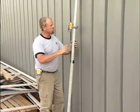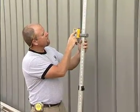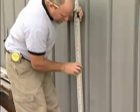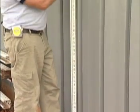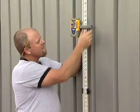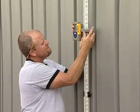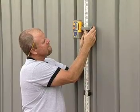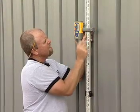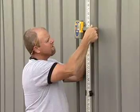We're simply going to switch it to the on position. You hear it beep — this does require batteries. Here is an indicator that I do in fact have it turned on. So now I'm simply going to put the bottom of my story pole to the elevation right there. You can hear it beeping. Now I'm simply going to loosen this — you see here there's an arrow which is indicating that it needs to go down, and what that means is it should level out. Let me loosen it up. Now I've got to go up a little bit. Right there. I'll tighten it down. See the green light flashing? We have a little line there as an indicator that we're in fact level with the way that we have the laser level set up. Tighten it down and we'll go to the next step.